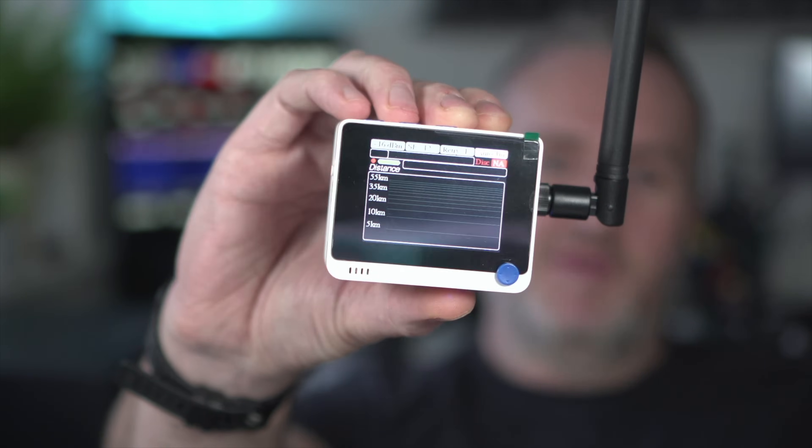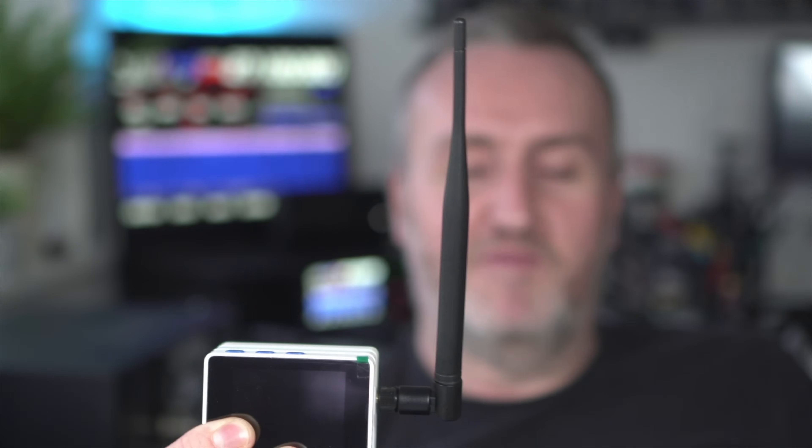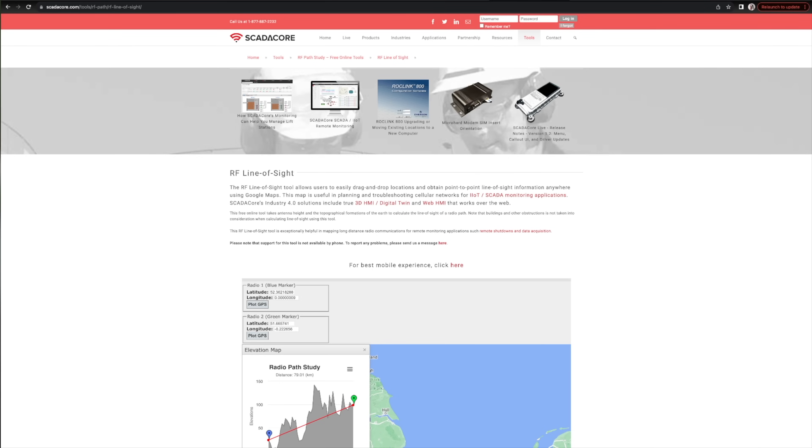The mapper tool I was using is a WioLoRa field tester with a built-in battery. You don't need one of these though — anyone can view the Helium mappers map. It's a great way to click on an area where you're thinking of deploying your Meshtastic node and see what distances have previously been achieved from that location. Most Helium hotspots receiving signals will have been using a similar antenna — just a little 868 MHz whip for LoRa.